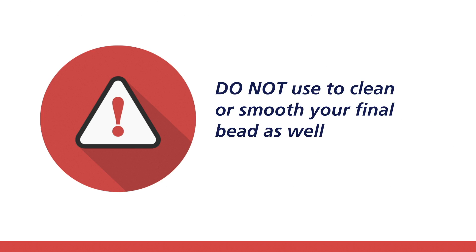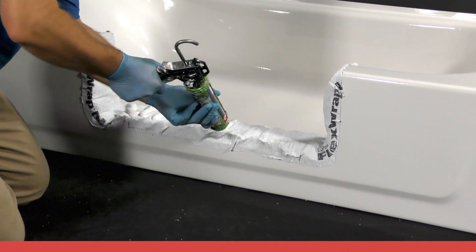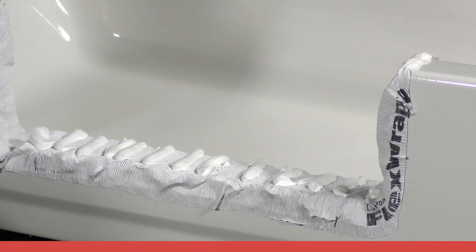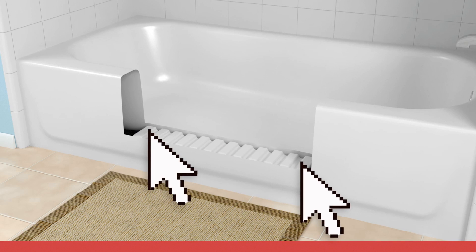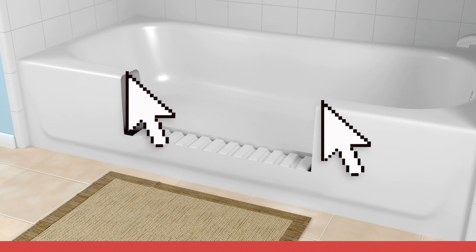Do not apply isopropyl alcohol directly on the adhesive as it will prevent it from drying or curing, and do not use it to clean or smooth your final bead. If installing the CleanCut Convertible or Door, apply adhesive to the top of the waterproof membrane. Place a substantial bead of adhesive on the top of the tub where the CleanCut Convertible will be seated, as this acts as a sealer and also reinforces the upright legs of the Convertible. If installing the CleanCut Step or Ultra Low, apply adhesive to the top of the large support box, with an extra bead on the ends since the step curves up toward the ends. Place a substantial bead of adhesive on the top left and right side of the tub where the product will be seated, as adhesive on the top of the tub reinforces the product.